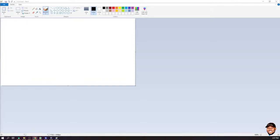Okay, thank you. Can you hear me? Yes, please. The question I wanted to ask is, in your power supply, aren't you using any power supply filtering? What do you mean by power supply filtering? Maybe filtering the power supply from, let's say, high-frequency spikes. I've seen in some designs whereby they use ferrite beads in the power supply filtering. Sometimes maybe 100 ohms at 100 kilohertz frequency, things like that.